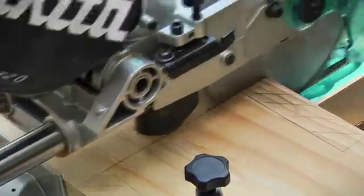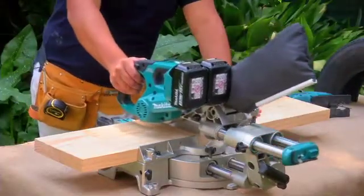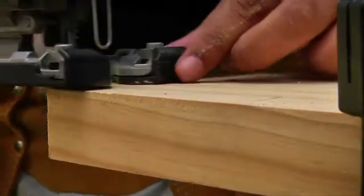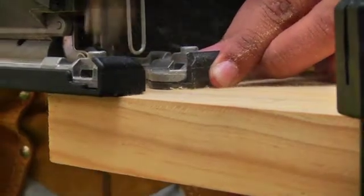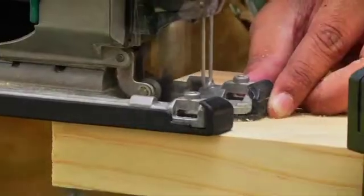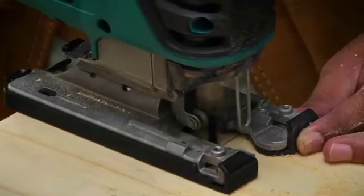Start by cutting the cleat to the correct length. Using a miter saw makes the job quick and easy. To cut the cleat to size so it will fit into the tire, make use of the jigsaw to remove the sections that you marked out. Remember to let the jigsaw do the work.